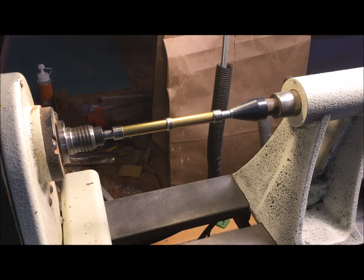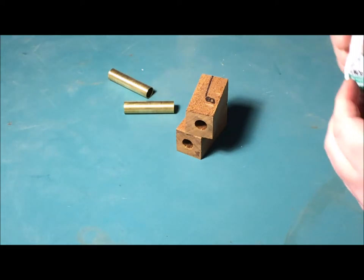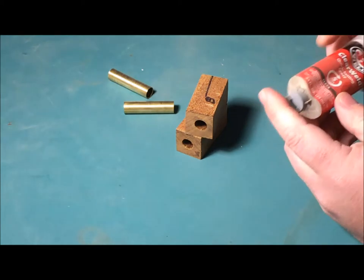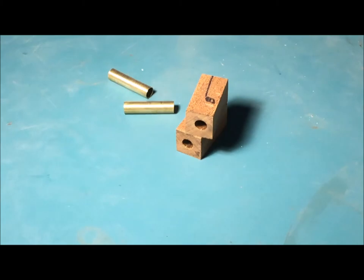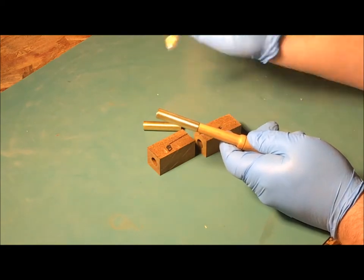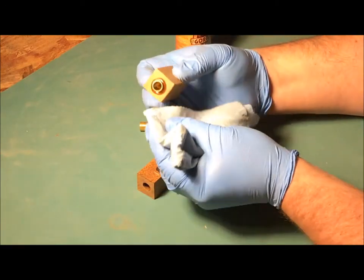Just a quick tip: you're supposed to rough up your brass tubes so the glue will hold better. I mount mine between the bushings and hit it with some sandpaper while the lathe is running. There are several different ways you can glue your brass tubes inside your wood blanks. You can use super glue or cyanoacrylate — that's good if you want a fast setup time. For a stronger bond and a relatively fast setup time, you can use a five-minute epoxy. For the strongest bond — the one I personally like — you can use Gorilla Glue or Sumo Glue, though polyurethane glues take the longest to cure before you can turn them. A tool that's really going to help with your glue-up is a pen tube insertion tool — it keeps a lot of the glue off your fingers. You can buy these commercially with a tapered metal rod, but since you have a wood lathe now you can make your own. The original pen tube insertion tool is a sharpened pencil.